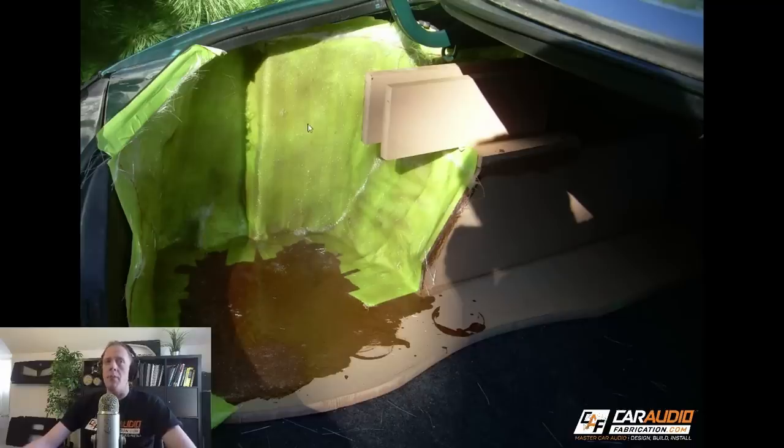I also should have used more tape. Rather than just one layer of vertical pieces, I should have done a second layer of horizontal pieces to make sure everything was completely covered - it makes that surface a lot more stiff and easy to apply fiberglass to. I also should have used some sort of mold release, because it was really difficult to get the painter's tape off. If I would have used a little bit of wax between that painter's tape and the fiberglass, it would have come off a lot more easily.